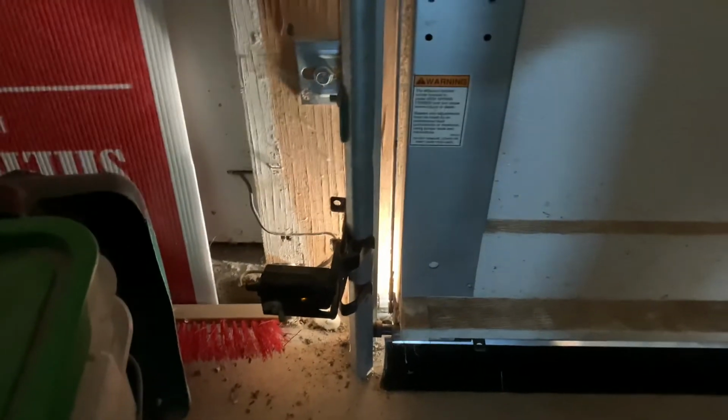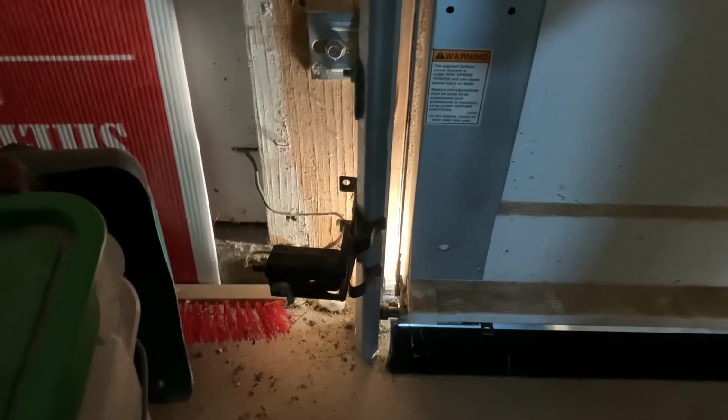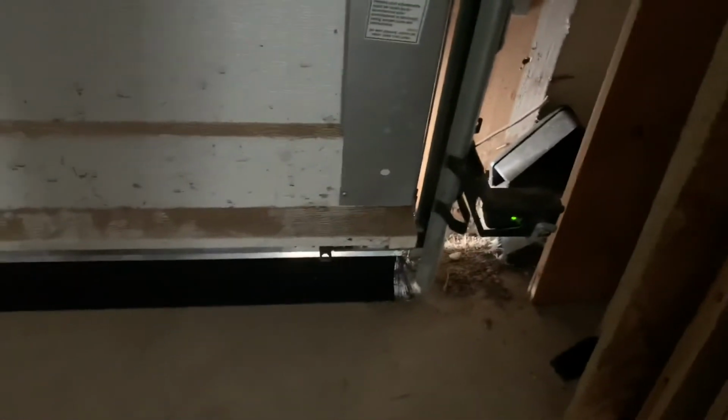We're inside the garage now, and I wanted to show you how much daylight's coming in, because daylight is one of the clues you can look for to see gaps where mice can get inside the structure. Let me show you my finger here to give you some scale. You can see how my finger is able to get past the door there. Clearly that is not accomplishing the goal that I want. Let me show you the other side. And here again, you can see my bait station there. This is not accomplishing the goal that I want with these particular Excluder door jamb gaps.